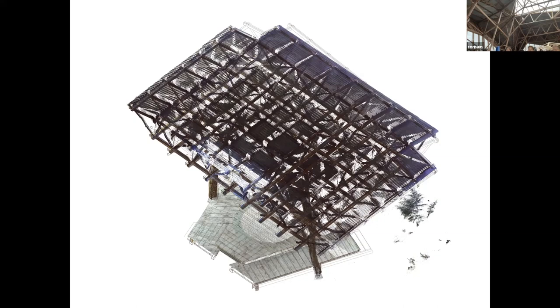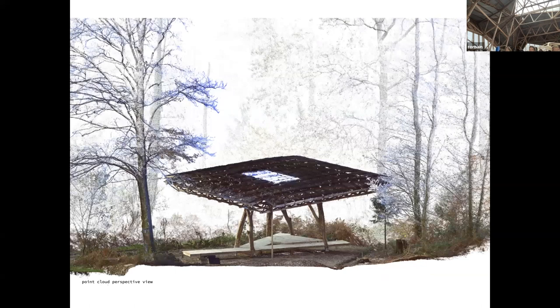Do you know what deflection we're expecting? Just under its weight. Yeah, so there's a temporary support that needed to be put in place. Oh, the back edge, you can see here. It's the first thing that you see as you arrive at the field station. But it was something that they had considered from the start. They knew that there was going to be some sort of sway, especially with the wind. But I think their main concern was if there would be some sort of vandalism happening, that if the frequency would be too high, then potentially the whole structure could fall apart. So that was more of a measure for concern.